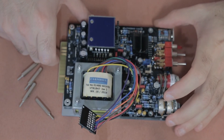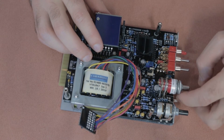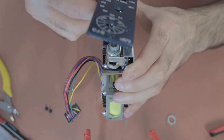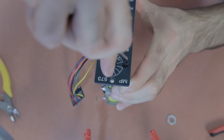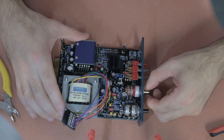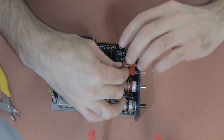Use four spacers and washers to secure the main PCB to the side plate — don't tighten them fully yet, just hold the PCB in place. Remove the nut from the Gray Hill rotary switch already inserted, then assemble the front plate, being careful of the LED light soldered to the main PCB. The front plate fastens to the side plate with two black M3 6mm countersunk screws. Once positioned nicely over all the switches, put the nut back on the Gray Hill switch from the front plate side, then if it's all flush, tighten the four spacers.